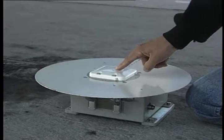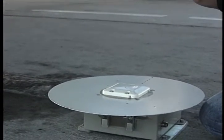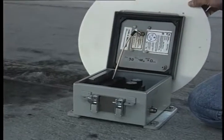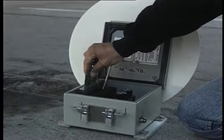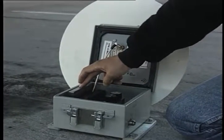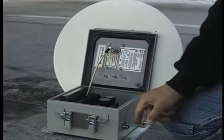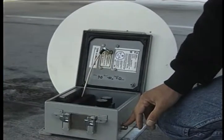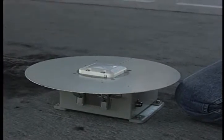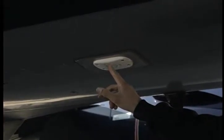This is one of our two ground transmitters. We have two transmitters on the ground and then one reference station — and that's all you need on the ground. Inside here we have one of our circuit boards inside this little silver box, which keeps the signal it's generating from going anywhere but out the antenna where we want it. That silver box talks to these two attenuators, which set the signal strength. The signal goes out the antenna and also out this connector to the reference station, which measures the signals from the two transmitters and from the satellites, and sends them all up to the airplane on a radio modem. The signals leave the transmitter and go up to the receiver antenna on the bottom of the airplane. There's another antenna just like this on the top of the airplane that's receiving the satellite signals.